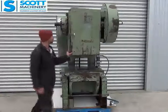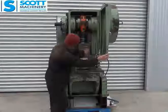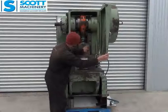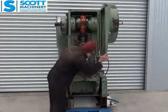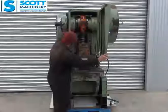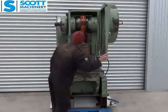The other things I noticed: there's been a little repair here at the bottom of the die face where something's obviously broken off and someone's put a steel flange in there — a very substantial one that's been gusseted very well and looks very strong. You'll see that in the photos. And one of the wee oiling pipes at the top of the slide is broken off, so that may need repair or not.